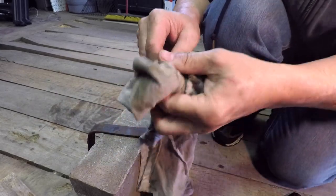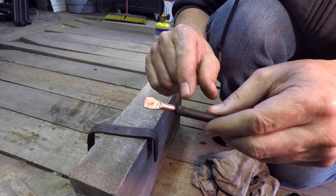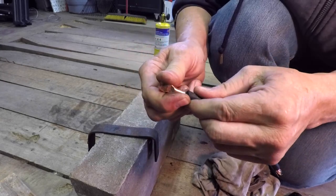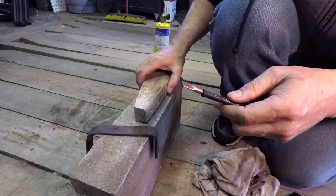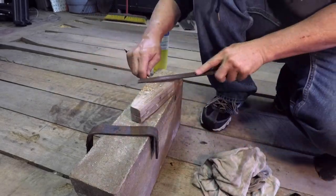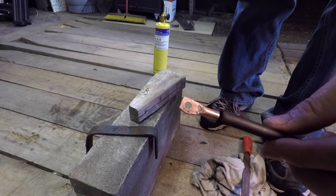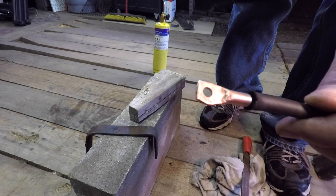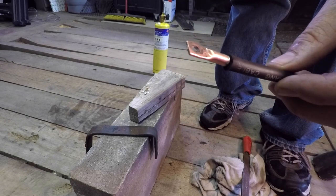I've got a situation where I'm putting three of these on the same lug, so I need it to be as flat as possible. Some people will run the wire all the way through the tube and then smash it down on the wire and drill a hole through that — and that's fine too. So next I'm going to take my drill and drill an appropriate size hole for the lug in the end of it. And that's what I'm left with — a nice soldered-on lug made out of copper so the conductivity will be excellent. It's not going to ever come off, and it was dirt cheap — basically free — it just took some time to build.